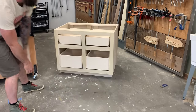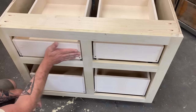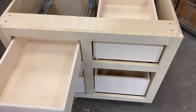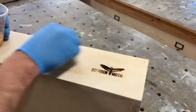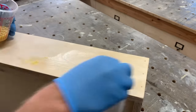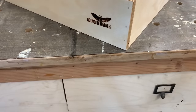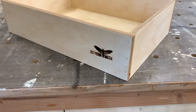On top of being incredibly easy to install, undermount drawers give you the smoothest glide of any drawer slide on the market — and no, I'm not being paid to say that. I'll include a link to all the drawer slide components in the video description below. Installed, we have the over-mount drawers on the left and the inset drawers on the right. Finally, I remove the drawers and finish them with a coat of linseed oil — in this case Rubio Monocoat, which is linseed-oil based. It typically only needs one coat and leaves the drawer box smelling wonderful, not chemically like lacquer or polyurethane.